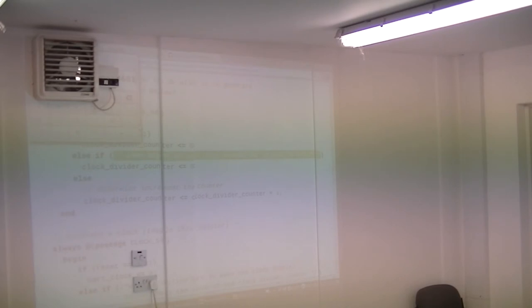8,680. That's nanoseconds. So we have 20 nanoseconds for the clock that we have, and we want a clock period of 8,680 nanoseconds, right? So obviously we know how many clock periods: we divide that by 20. Is that right? 8,680 divided by 20 is 434.